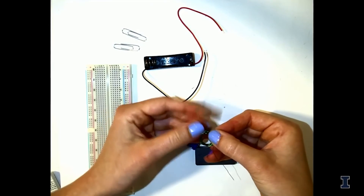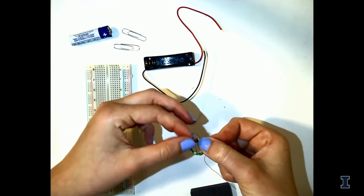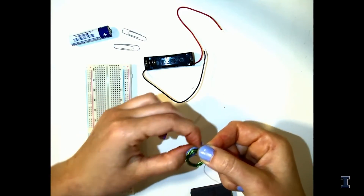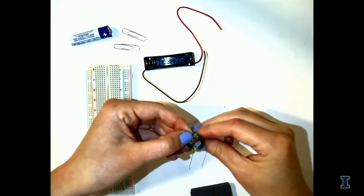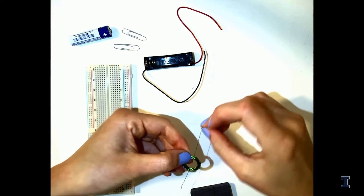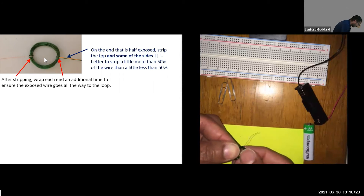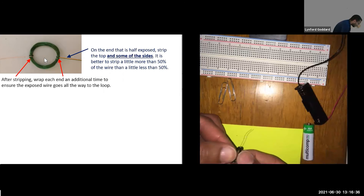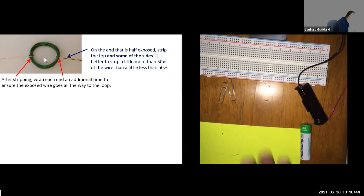Take the two-inch ends of the wire and loop each one through and pull it out the other end two or three times, because we want to make sure the loop stays in place and stays snug. I just did two windings there; turn it around and do the same with the other side — wind it through about twice. Now I can see exposed winding right up against the edge going completely straight across. When I rotate it, the key part is that this end is exposed at the top and not exposed at the bottom. That is how the loop is created.